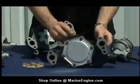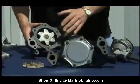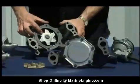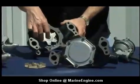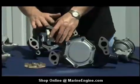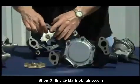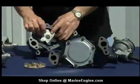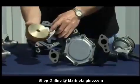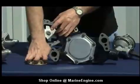All the components on the marine water pump are brass or anodized for corrosion resistance. And most importantly, the impeller. On this automobile water pump, this is a stamped steel impeller. Since in the marine environment they're very likely not running antifreeze, this impeller is going to rust with the water. In the marine environment, they use a brass bi-directional impeller to keep that water pump working for years to come.